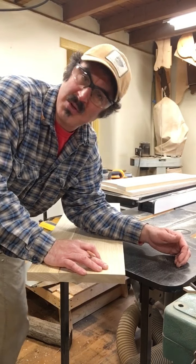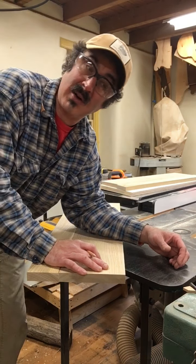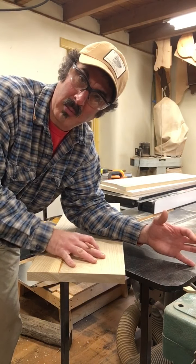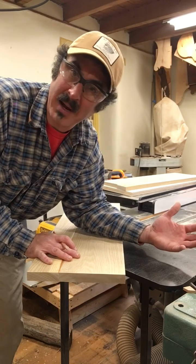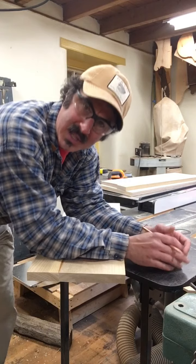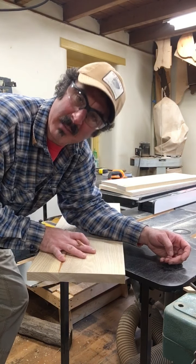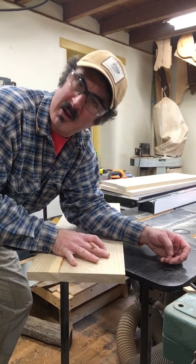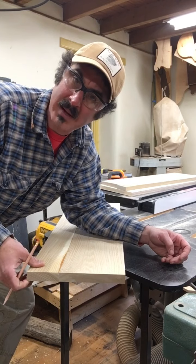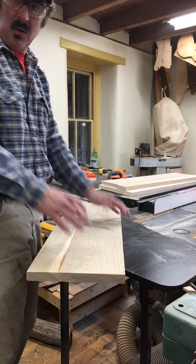So using today's materials, the wood that we have that doesn't last as long, I think it's a pretty bad idea to do that. At the very least, I would want to do wood, and then I'd want to paint it, and then I'd be up there painting it every 6 years, which I don't want to do either. So I have an old metal sign that's in my barn, and I'm going to take this piece here and taper it, and then put the metal sheet over top of it, and I'll just tuck that around the front to put a little drip edge out there.